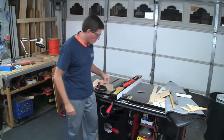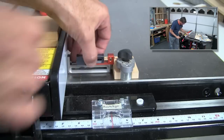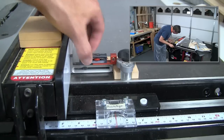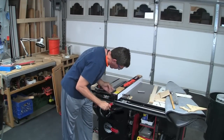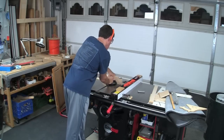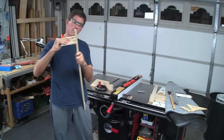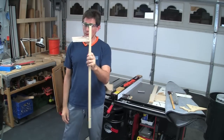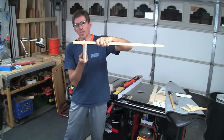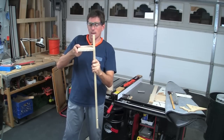Now we're going to make the other shoulder cut. I'll take the KM1, flip it so now we're going on the short dimension — that's actually why I made this little piece of MDF kind of short, so I can tuck it in underneath. Now I'm going to scoot this fence over until I hit that reference surface again, and now we're going to make the second cut. Perfect — and there was no measuring. There's just enough friction that if you were kind of gentle, you could probably leave it in there, but I'm not having to beat it with a mallet to get it in.